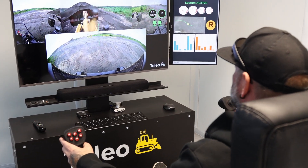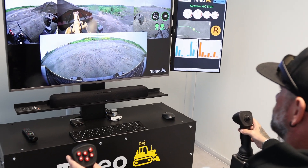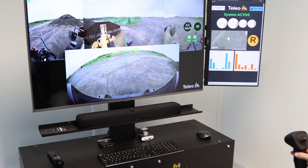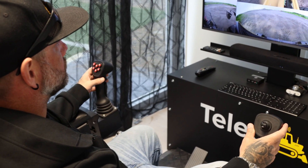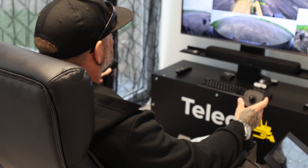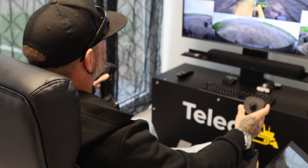It's really easy to use. You've got a bunch of different views, you can change a couple views on the fly. You can look under your bucket. You've got a bunch of cameras for reversing, you have one inside the cab — you can see the gauges. What I love about this is you're able to run tele-op, so I'm in full control of the machine. And then in this application for tramming, they build essentially a geo-fence where as soon as you get in that geo-fence, you can click auto or autonomous mode and it knows where it is.